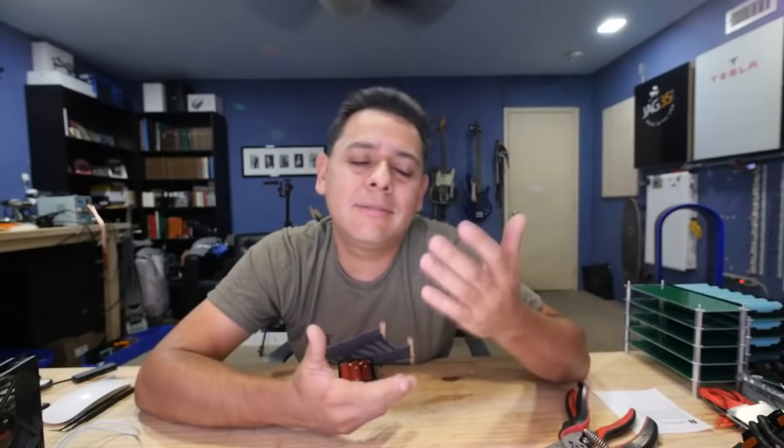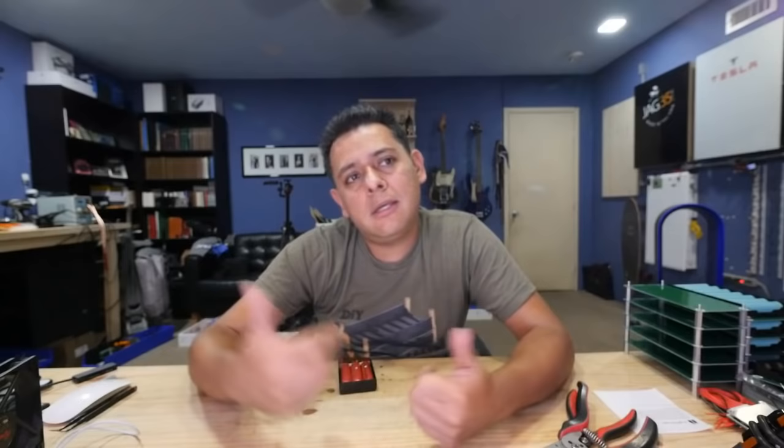So it depends, right? I'd have to look into that, because what runs on AC? If the motors run on AC, then you have to run it through an inverter. But if nothing runs off AC, then you might be able to change that motor. It'd be messy. But there's a lot of stuff you can run on DC, and it'd be great because then you don't get any inefficiency. You just run it straight off your battery. All it is is motors, right? It's a compressor and a fan, a blower motor. All the electronics are going to be DC, so that means it's going to be a rectifier, a bridge rectifier. So you load it up with DC and it's ready to go. It just bypasses the thing.